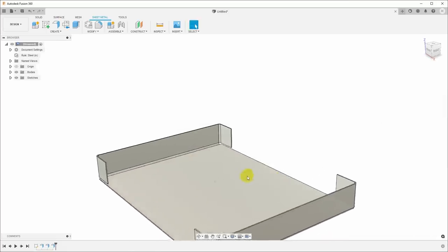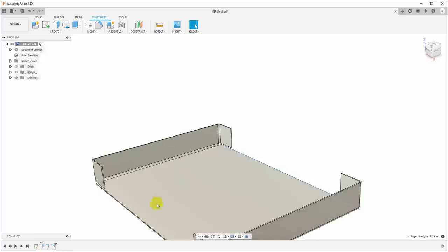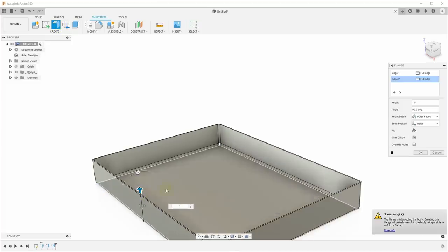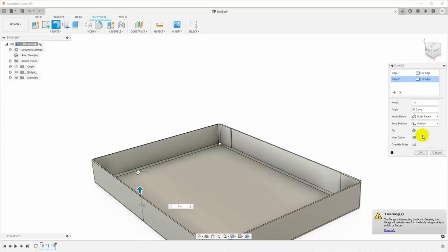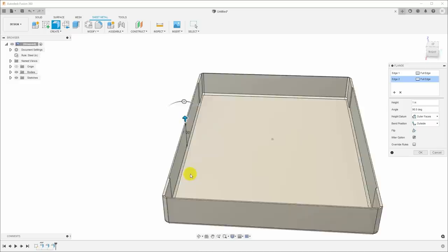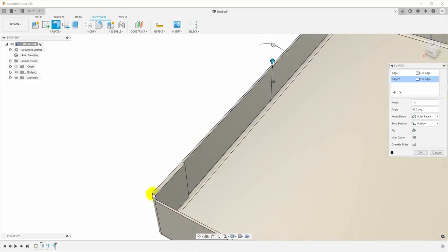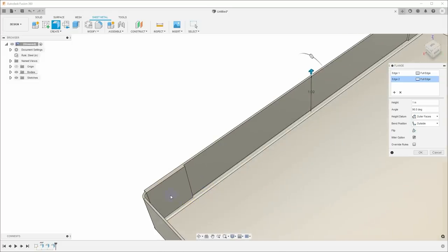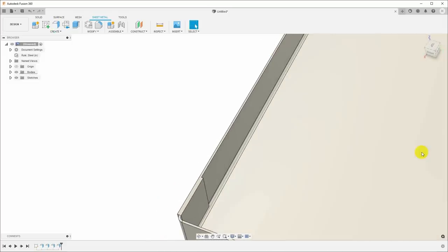And then when I pull up the sides of this, I'll just click and Control-click here and pull up flanges on the sides, the same 1 inch. I want to set those to outside. So what will happen then is those flanges will pull up on the outside of the edge and the tabs pull on the inside, so they'll be flush with each other, and that'll give me a place that I can spot weld these together.